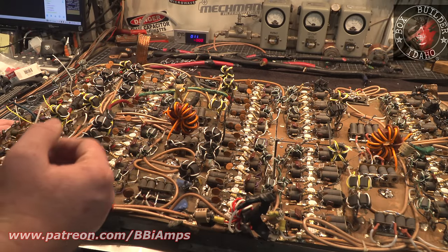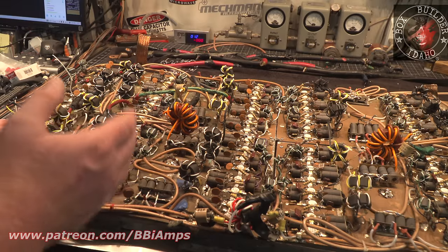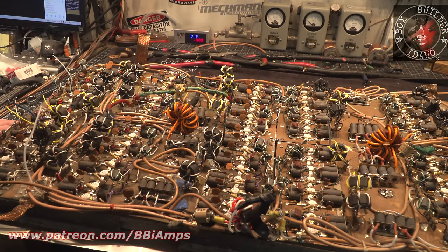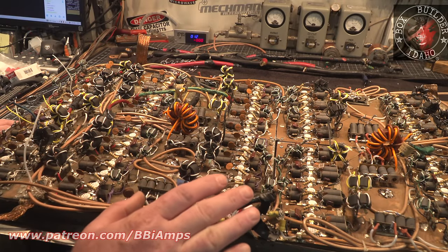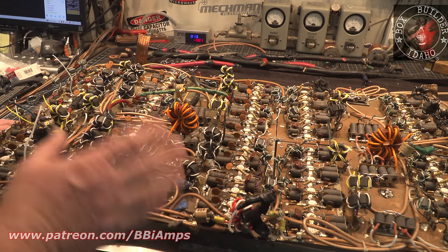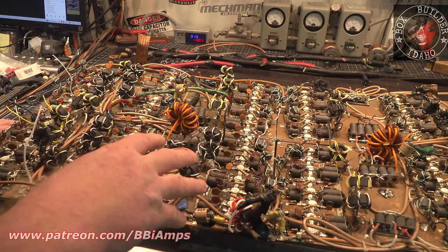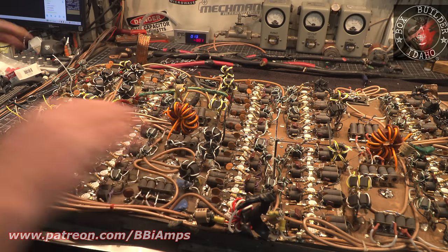Another third of the problem is this has got 2879Cs in it and an amplifier that was designed to run 2879s, Toshibas. The two parts, which we have universally accepted, everybody has come to understand. Everybody knows. Everybody gets it. It is a fact that the 2879C does not work in the circuit, these parts that surround a 2879 Toshiba. You cannot swap the two.